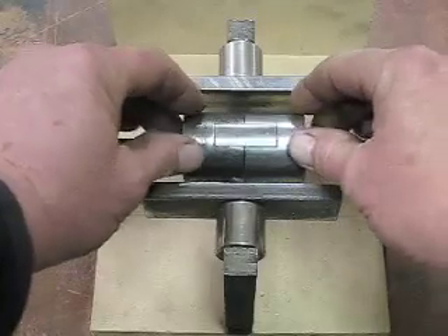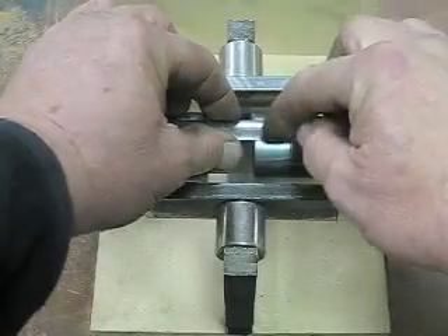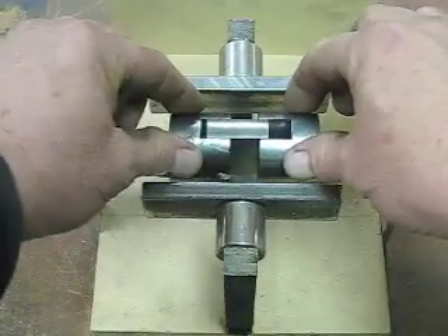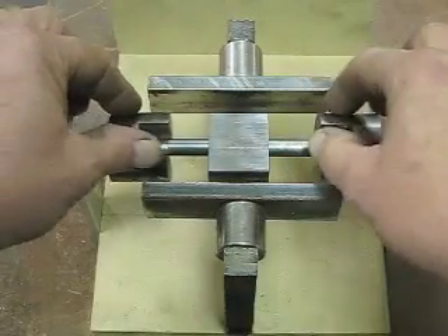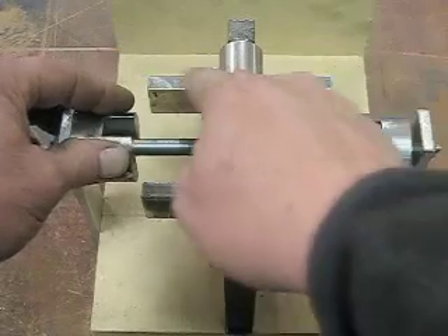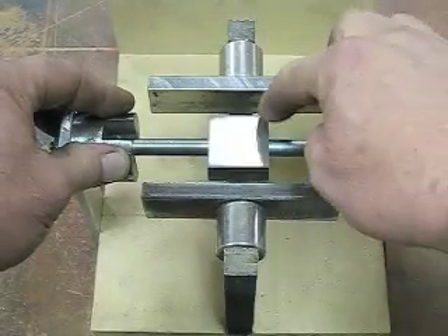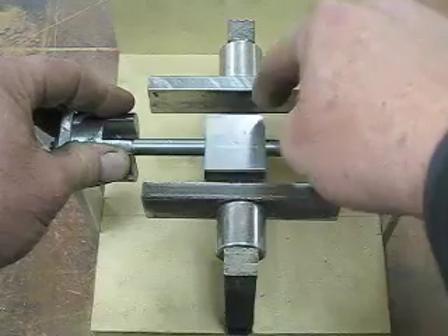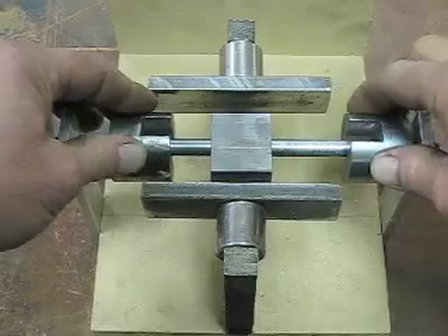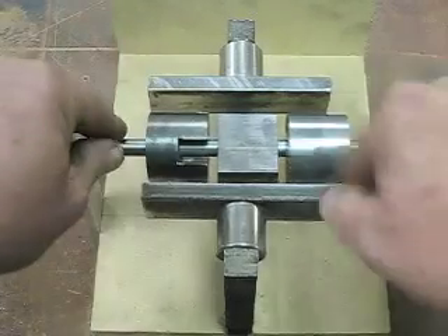So when they pull out, it's even just less effort now — they'll pull right out. Now this is hanging up probably a little bit in here, but it'll flip over like it did. There seems to be a little bit less cogging, probably because the field is much larger now instead of before, when it was just concentrated right here. But it still cogs and there's still a fair amount of cogging and a fair amount of pull.